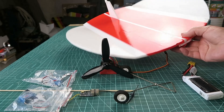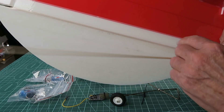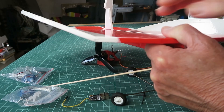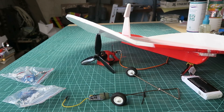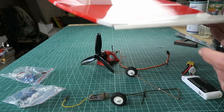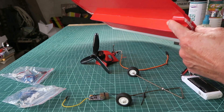The main body has been done and covered with packing tape, which gives it strength. Underneath, I just used a barbecue skewer to do two functions: one was to put it in the gap to get the correct angle, and obviously that's going to provide some strength and rigidity. The elevator and rudder are clearly visible — those are all our control surfaces. I've put a rib along the bottom for additional strength and to support the motor mount.